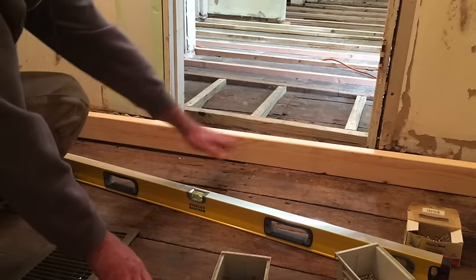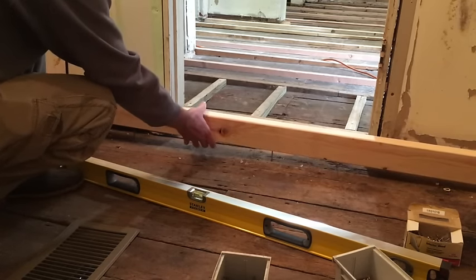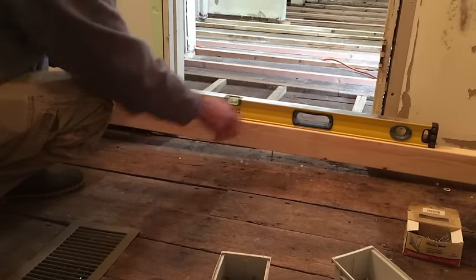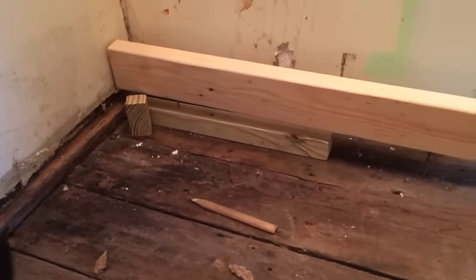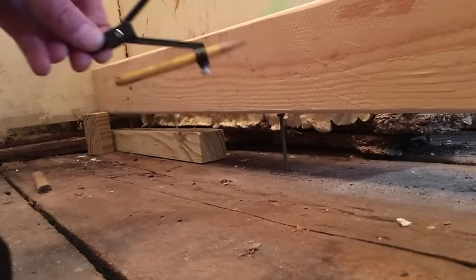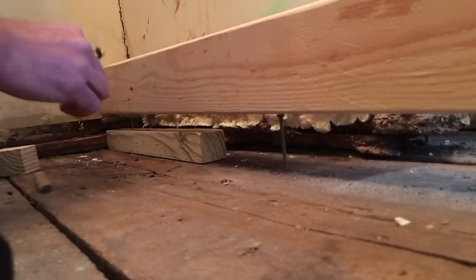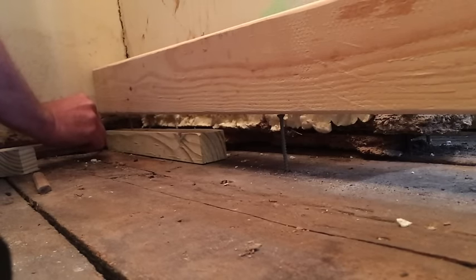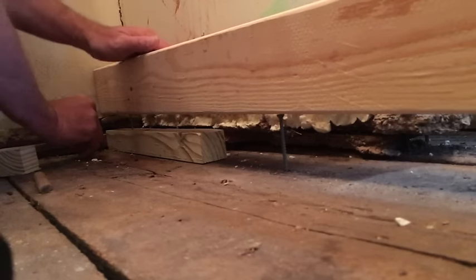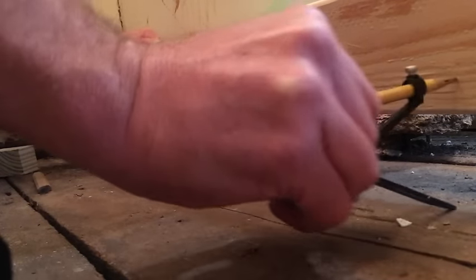I picked a very straight 2x4, but not only does the floor slope in one direction — there's some bowing, so it's got a little bit of contour to it. I set the 2x4 on top of the screw heads and if I set the level on top, it shows as perfectly level. The next part is key to this whole method: scribing the line that follows the contour of the board underneath. Option one is to use a caliper scribing tool — it looks like a compass, about two dollars at Home Depot.